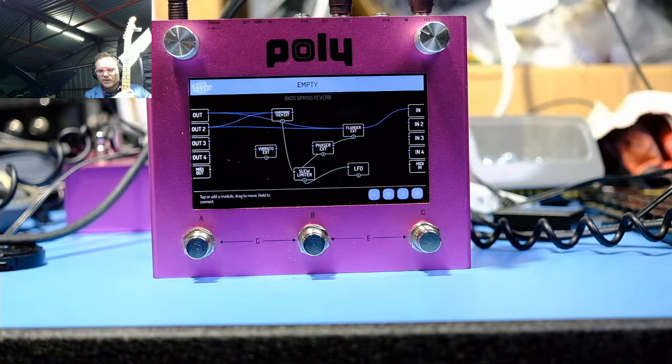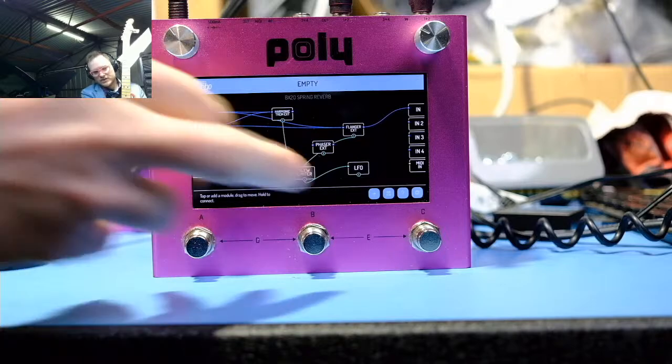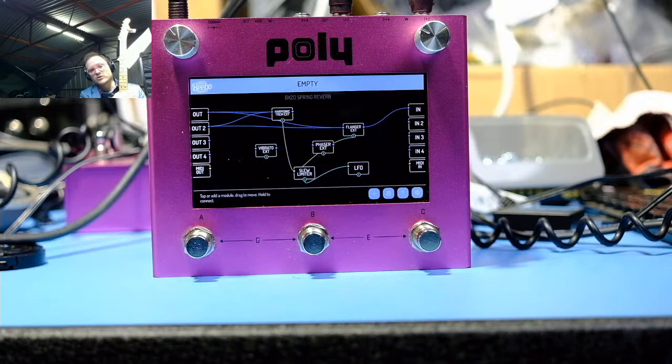That is confusing if you have a bunch of modules. You'll probably have to work out something more cunning if you do want DSP bypass for some reason, because if you're doing some more complicated routing, normally if you're using the analog bypass, which is the normal way if you just hit the bypass button, it connects the inputs to the outputs, so that'll just connect input 1 to output 1, input 2 to output 2. So it's very limited as far as the routing features then.